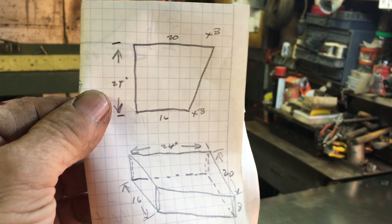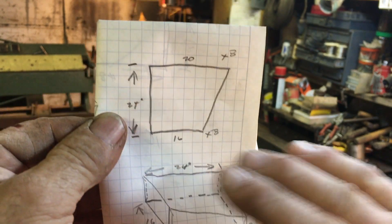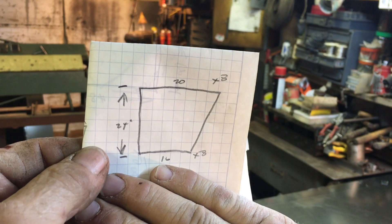So you transition that duct down from 20 inch, usually in a 4-inch increment or thereabouts, to drop to 16 inch. Today we're going to lay out some transitions and show you how those look isometrically, how you lay them on a piece of metal, and what you do to make them. What I've drawn here are two transitions that we have to make — they're identical but I've got three different ways of looking at the transition.